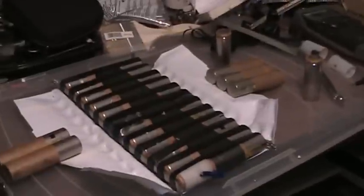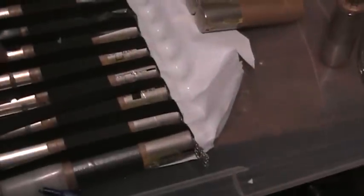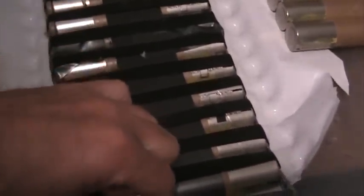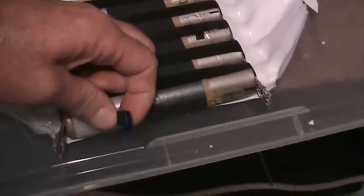The batteries are much bigger capacity now. I'm reassembling several of these to go into a battery — about 168 cells. You have bus wires like this which connect together on the ends with the copper buses. The copper bus carries a high current, and then you have a small cable that goes through one center post of the battery, giving another contact point for the BMS system to do its measurements.